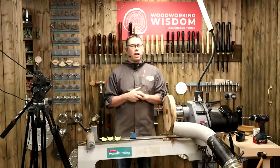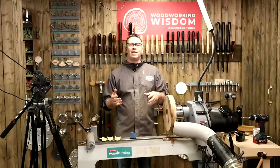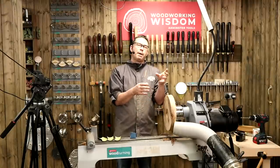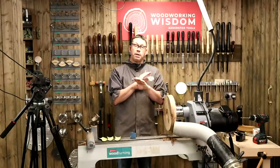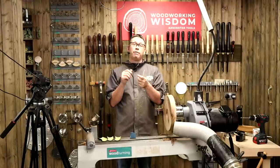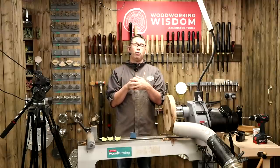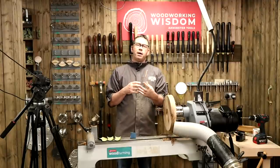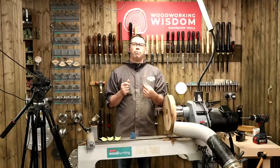So just, yeah, what I would do is seal the end grain, leave it for a while, don't finish it, and then bring it back, maybe put it back on the lathe just to true it once it's completely dry, as long as it stayed whole. But yeah, for the minute, shove it full of dilute sealer so it can soak in a long way,